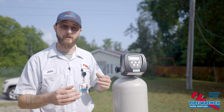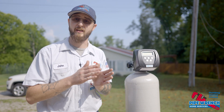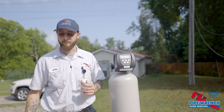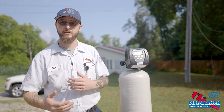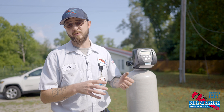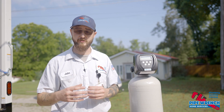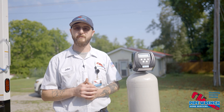For example, with hard water, the mineral scale that builds up inside the water heater acts as an insulating layer between your heat source — your element, your burner, whatever the case may be — and the tank itself. If there's that built-up layer between the water and its heat source, it takes more energy to heat that water up, and as a result the water heater is less efficient. In the case of electric water heaters, if you build up enough of that scale, you can bury the element in it, and if that element cannot come into contact with the water to disperse the heat it's producing, it'll actually blow out. So the idea of all this is to protect your plumbing system, protect the investment that you've made, and help extend the lifespan of all of it.